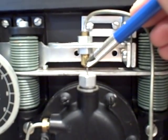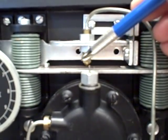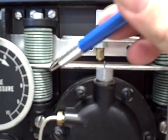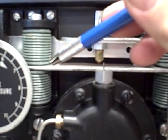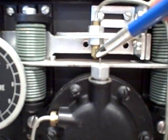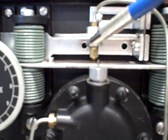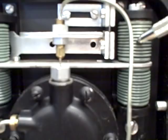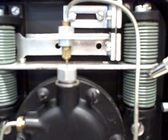As we apply an input pressure to the instrument, it's going to pump up this lower bellows. We're going to see the left-hand side of the lever rise up. That's going to try to bring the flapper closer to the nozzle. Remember, this instrument is doing its best to hold that gap constant. So in response, it pumps up this bellows on the right, moving the right-hand side down.